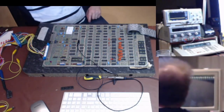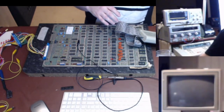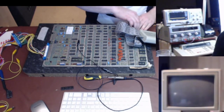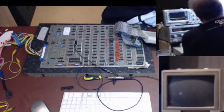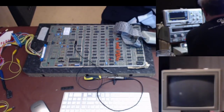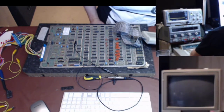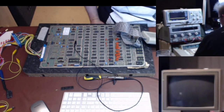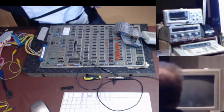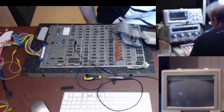Right, okay, let's get the other Fluke pod. We're fortunate we have a second Fluke pod, so turn the Fluke off. Also, reseat the connector for the Fluke. That could be causing it, easily. It wasn't particularly well seated. Let's try that again. No bad power supply. Right, turn that on. Nope. Bit 1 tied. Bits 0 and 7 tied.